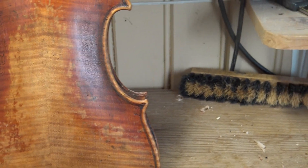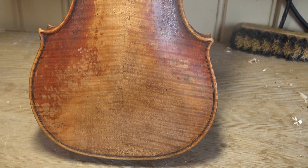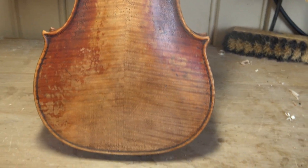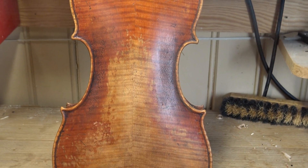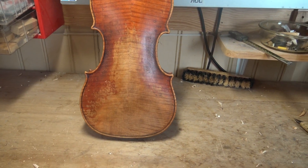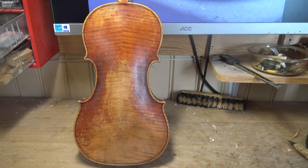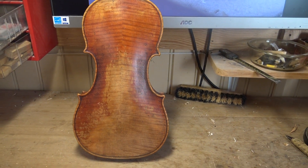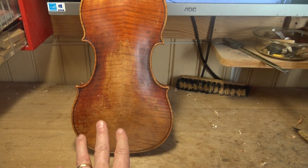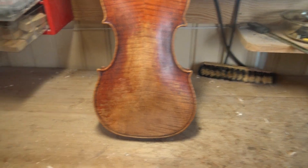It's not just one color — dirt is many colors. That is one of the reasons not to mix too many colors. I can also take off with alcohol. Since it's egg white in the ground that protects the wood, if I want to take it away I use water, because water dissolves the egg white. You have to rub it a little bit. Then I took my dark stain, my positive stain, and treated this area after bringing the egg white off.